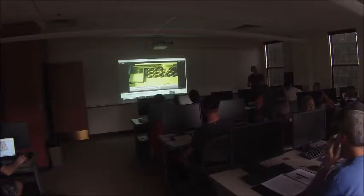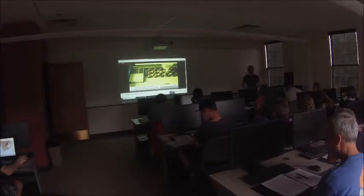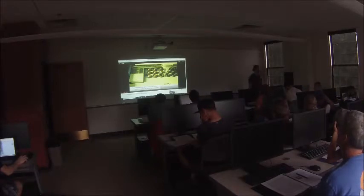Now, lasers create really smooth surfaces. Plasma, not so much, but it's still not bad, especially in thin material. One thing I didn't mention, plasmas can cut thicker materials than laser, like 3 inches. The company I work for, Eagle Crusher, uses plasma tables for cutting really big pieces of steel for making rock crushers. And then oxyacetylene, kind of continuing the progression.